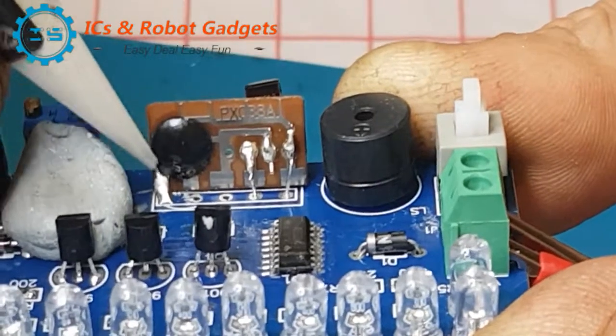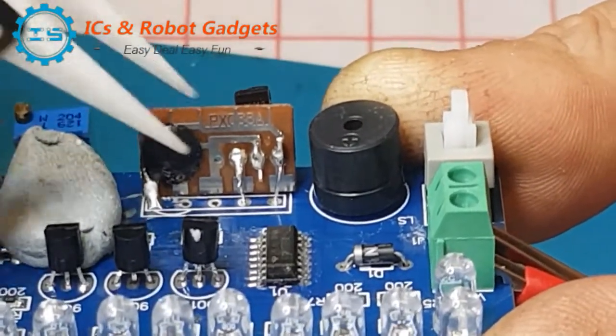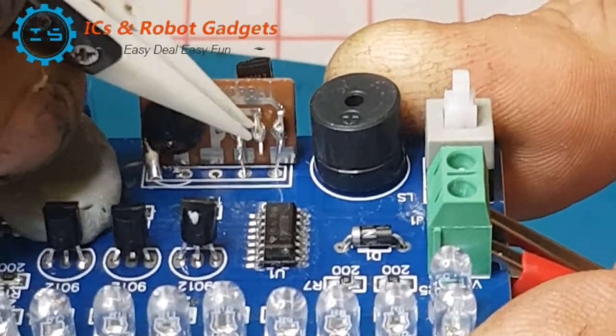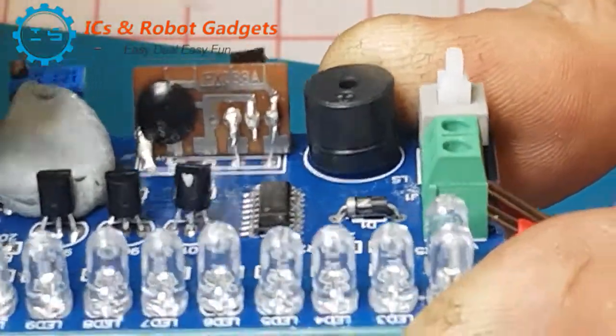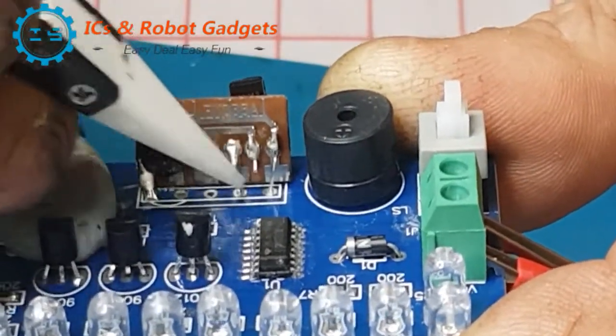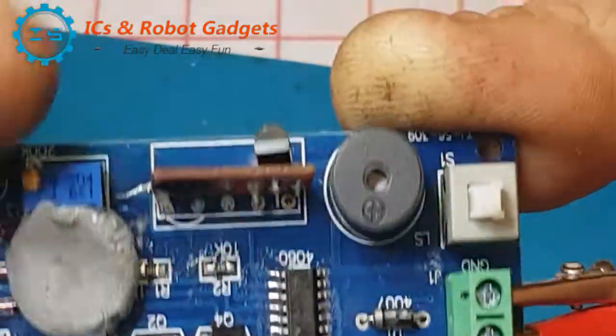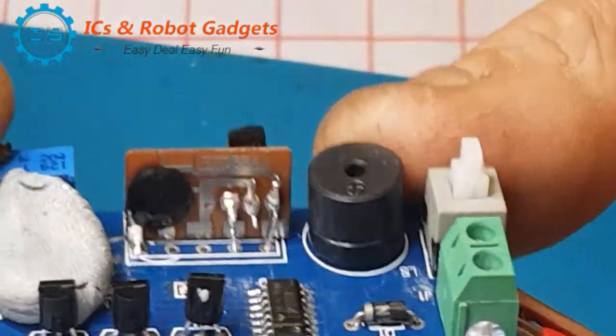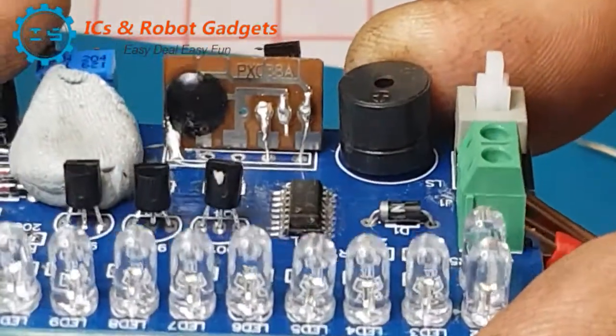that's been soldered down to the board because that's VCC or the positive. So the middle pin only goes through the emitter, I think. That only solders into the board, and then you can cut it short. So it's the first and third pin go into the first and second hole on the board there. So as you can see, there's the transistor, and that's as good as I can get you.